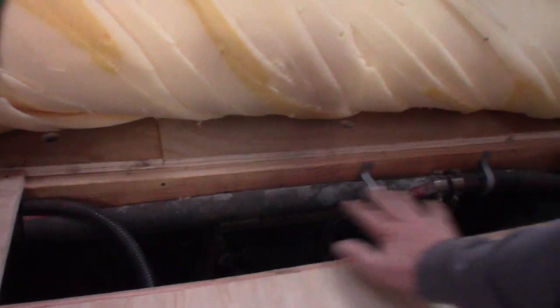When I started to put this headliner in, the wiring was in my way and I said, screw that. I tore all this out, rebuilt it, and built these cabinets. What I did was I cut the wires in the middle and put two labels on — one here, one here — then cut between the two. So here's an example: this is wire T. I had a T on each side and cut between the two T's. Now I have my end on the port side and an end on the starboard side and I have to connect them somewhere.